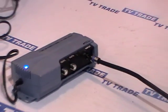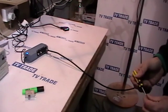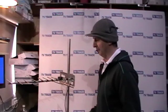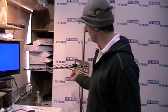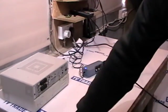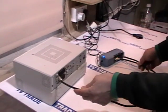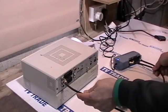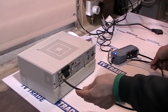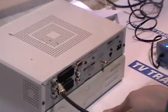You can get into trouble where you have a signal that's too low, but equally you can have a lot of problems if you have a signal that's too high. For example, if we had this signal coming from the aerial into this distribution amplifier and then we had a cable running from the distribution amplifier into the back of a skybox, it would be very common that you would have a distortion in the picture when you try to feed and loop it off to other rooms. That's simply because the strength of the signal going into the skybox is too high.